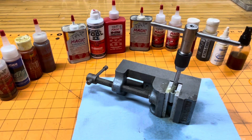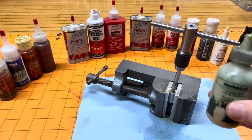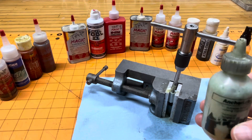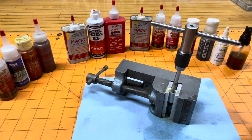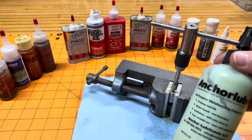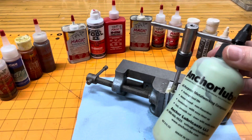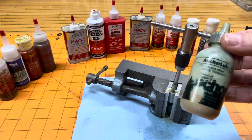If you're ever running into the same problem, and you probably have one of these tapping fluids already, get yourself some Anchor Lube and mix it up. The ratio I use is half and half — it's thick enough that if you hold it upside down without squeezing, it's not going to run out. If you drop it on your workbench or on the floor, it's not going to run out. I really like Anchor Lube and it has its place — if you're working over your head on an I-beam tapping on a scissors lift, that's the way to go. But in the machine shop, a mixture of half Anchor Lube and half your favorite tapping fluid is the way to go.